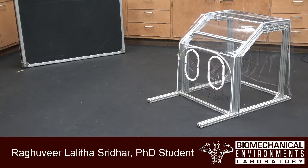So the panel has now been draped over the frame. So the frame will actually be used to glue the side panels onto the main panel. These flaps will be bent down and thermoformed so that they lay flat on the frame.